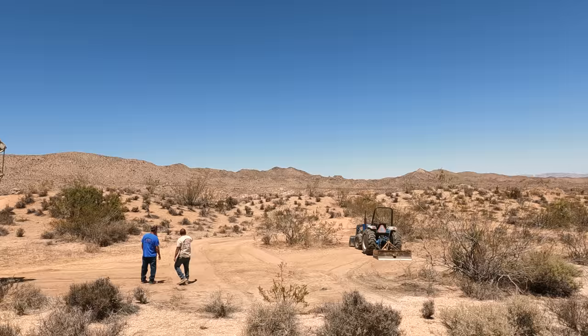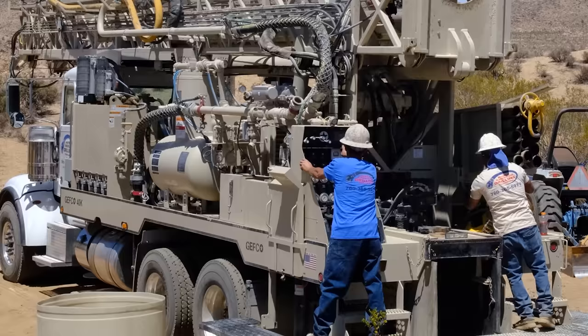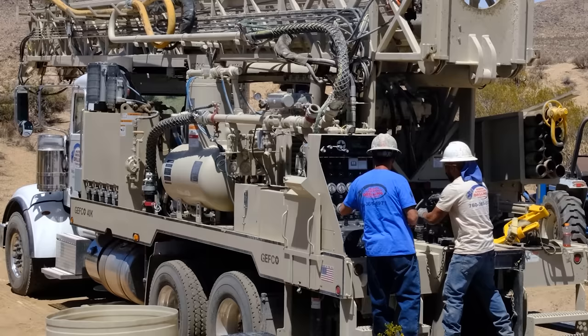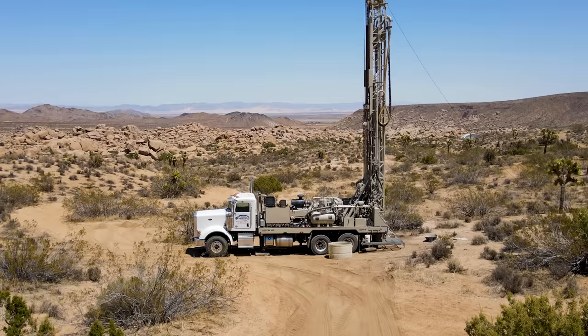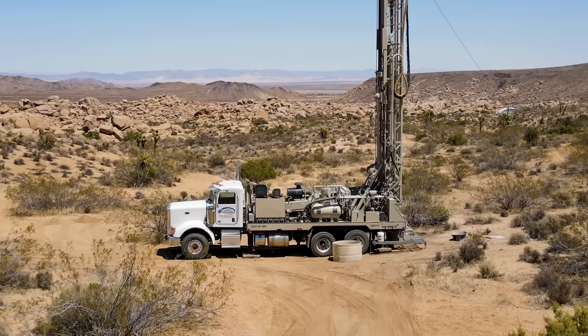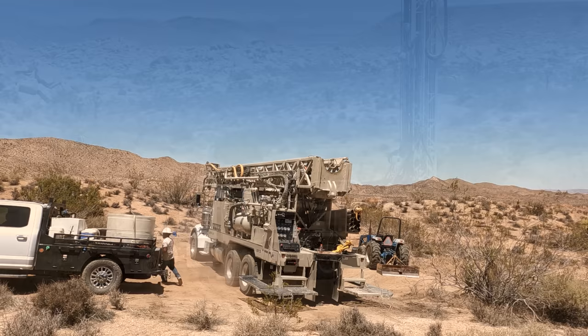Then the drilling machine arrives — quite an impressive machine, a lot larger looking in person. Lots of hydraulics, big pumps. It has a really enormous compressor and air pump on it, because the end of the drilling head — the carbide tip — is an impact head that has to break through granite, and it uses compressed air to do that. They also have a huge volume air compressor to pump all of the cuttings and water out of the hole all the way back up to the top. All of that is located on this one truck, with support trucks showing up to fill it with fuel and replenish the water tank.